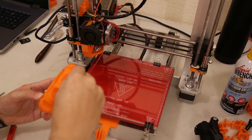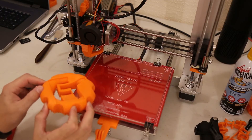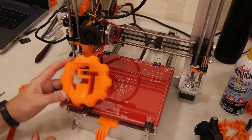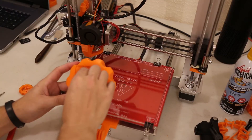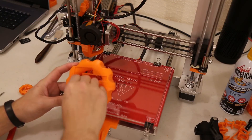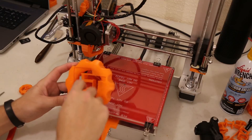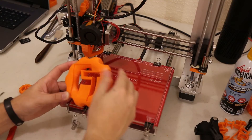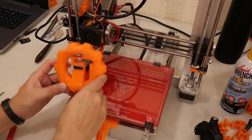There's a little bit of zitting as some people call it in a few places, but that's real easy to just pop right off. And up here you can see there's a little bit of stringing. It's super fine — I think it was just because it had to do these final few layers going back and forth at such a small layer height. 0.1 is pretty small. Most printers can only do 0.1, and I normally print larger objects like this at 0.2.